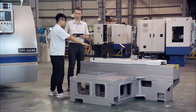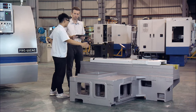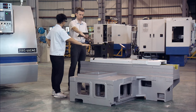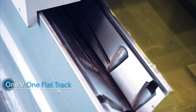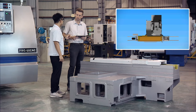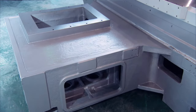What's special about the design? For our X-axis, we have the super wide double V design. And for our Z-axis, we have one V and one flat design. That is to increase the contacting face of the tracks. The perfect distance between the two tracks is absolutely crucial when it comes to heavy cutting because it provides just the right amount of support while maintaining precision.